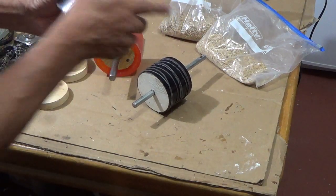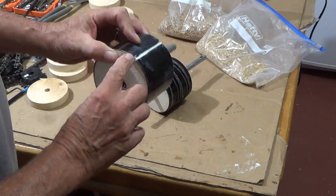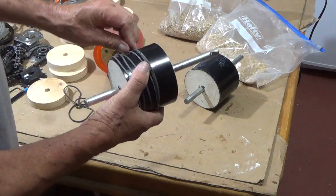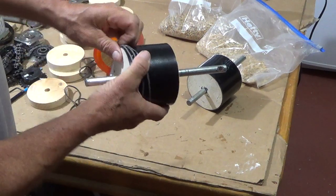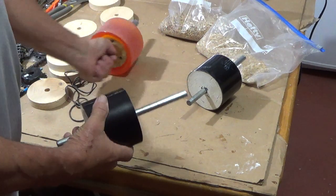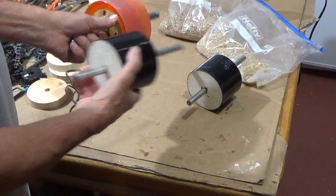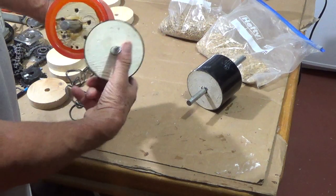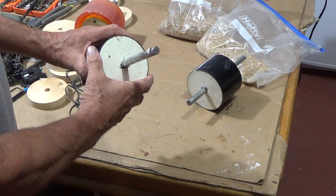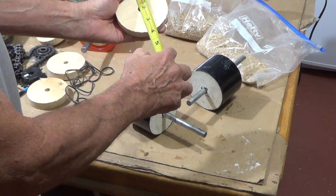Now I've got the 90 durometer polyurethane sheet epoxied on here. I filled in this gap with some epoxy, held it in place by hand since it was five-minute epoxy, and also had rubber bands on here. It's been curing for a day, so we're getting ready to set it up. This was the roller that we used — that is a boat roller, which is also polyurethane. As you can see the width is the same but the diameter is different. Using my hole saw, this was a size I could drill out. These are three and seven-eighths inch diameter.